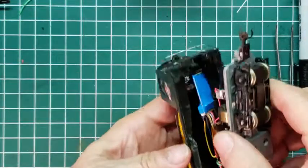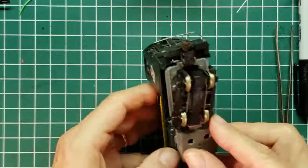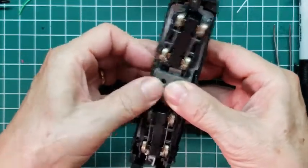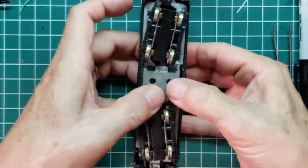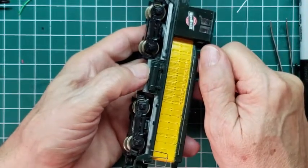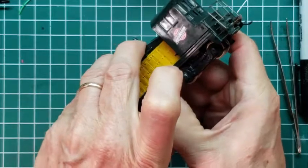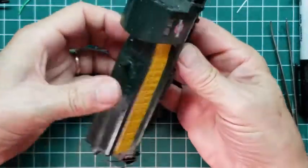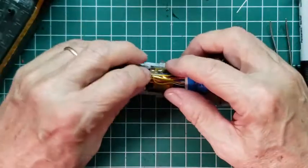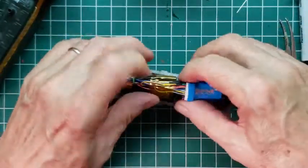So these wires. Yeah, see, the wires at the very top of the motor now are an issue, because they're not allowing me to come down that extra 30, 40 thousandths there, so I can snap this into place. So we've got another issue we're going to have to address here, and that's the wires on top of the motor. Wow. Why didn't I see this coming? A simple install all of a sudden has got all kinds of consequences here. These wires have to be flattened out as flat as possible in order to get the shell on. And see, they're even compressed a little bit as I do this.